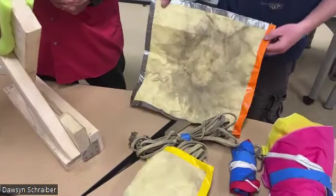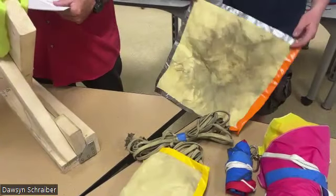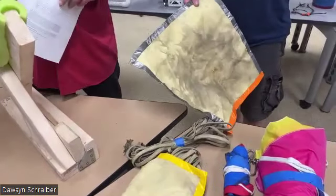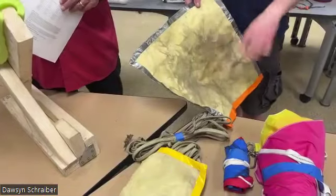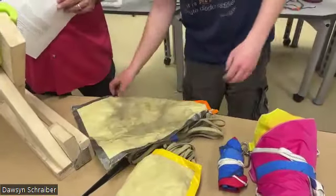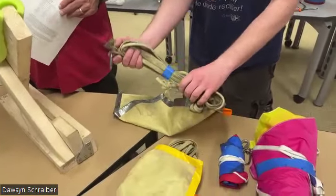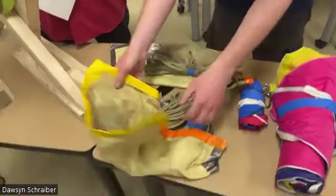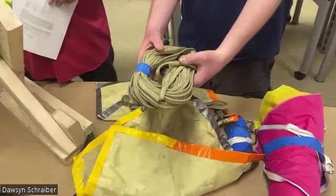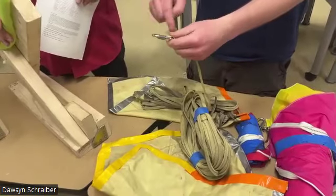These work fine, just like Nomex. It's pretty hard to burn Kevlar. So we've been flying these, and they work great. We also use dog barf, in addition to this, as some extra shock cord protection. These will go around the parachutes. Like you mentioned, shock cord, this is 30-foot length for main, and then the drogue is a nice long 60-foot length. That's about 5 times the length of the rocket. That's the rule of thumb that we go by. Points of connection are all bowline knots with quick links.